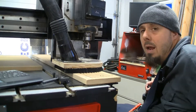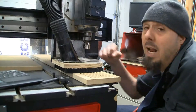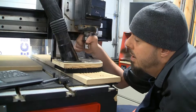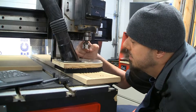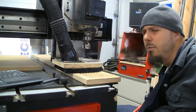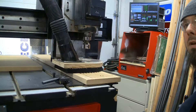Before I actually throw a router bit in there, I'm actually just going to run the spindle once empty, just to make sure that I don't hear any vibration or anything. It should actually be pretty well balanced. There's a hole right there - that's a balancing hole. To make up for the set screws up on this other side and all that threaded hole and machining there, they put a hole in there to actually balance these. They're rated, I believe, 22,000 or 24,000 RPM. So I'm going to grab my safety glasses, grab the keyboard, and let this thing spin. Alright, everything's clear, everything's ready. I've got the machine reset.